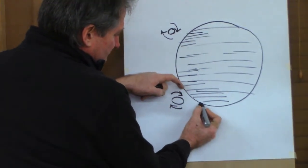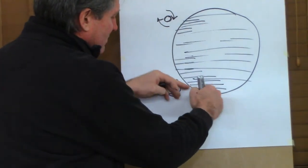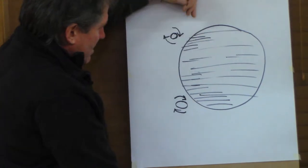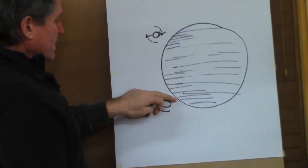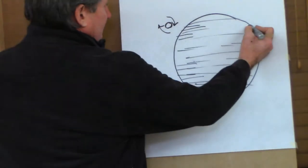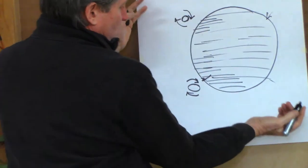In this quadrant here, it wants to tear out because it's feeling the ends of the grain more than here, because it's coming up behind them. Here, it's coming in behind. Here, it's coming into them. So you get more of a potential for tear out on this quadrant and this quadrant here, these two. These two are fine, no worries.